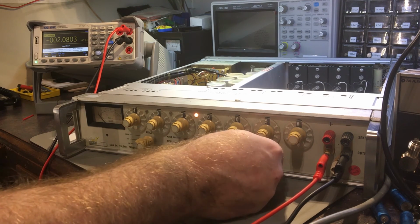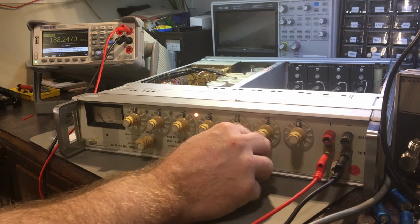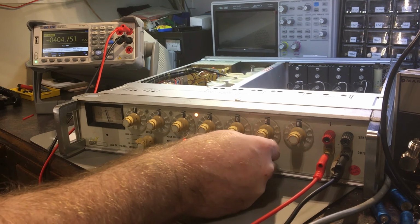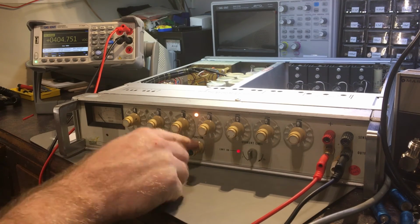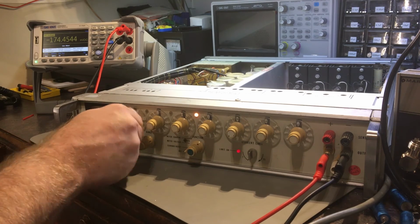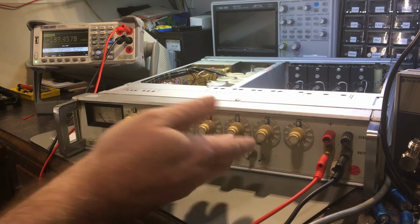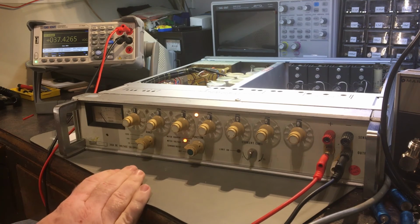That's the limiting coming on, which is what it's supposed to do. As the crowbar kicks in, if the voltage drops, the crowbar comes in and drops it off. And above 300 volts, it actually keeps it locked off if the limit comes on. But if you're on like 100 volts, I think it will work on there. If the limiting comes on, the limiting just comes on. It's fine. And then when you put it back up again, it doesn't actually trip.